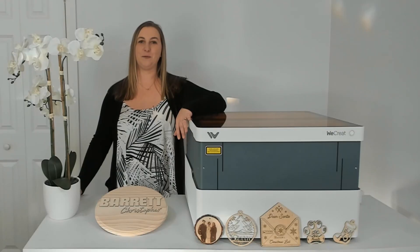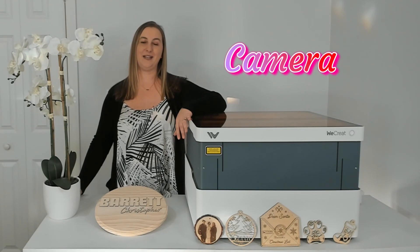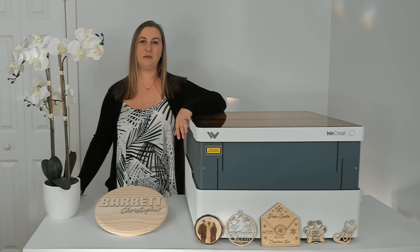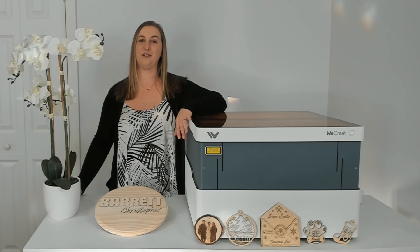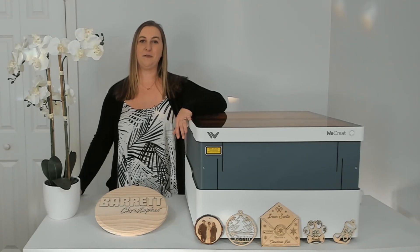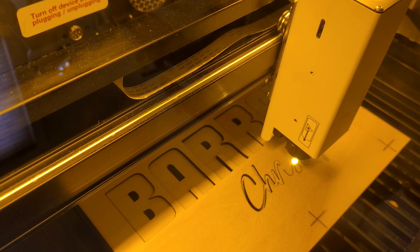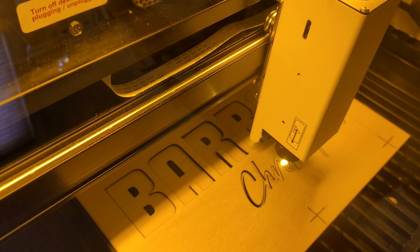This machine comes equipped with five-in-one built-in accessories, including air assist, rotary, laser bed, camera, and enclosure. Air assist is important because it makes your design cleaner, preventing ugly burn marks that occur from laser engraving without it — it blows air at your project when it's cutting or engraving to keep it looking great. A rotary attachment is what you need to engrave round objects like tumblers, cups, wine glasses, and other round blanks. Without a rotary, you can only work on flat projects. This machine also comes with a laser bed, allowing you to cut through materials easily, and a collection tray where scrap bits fall through for easy cleanup.